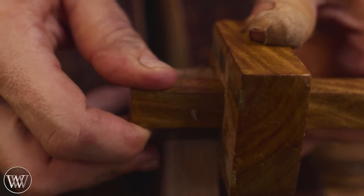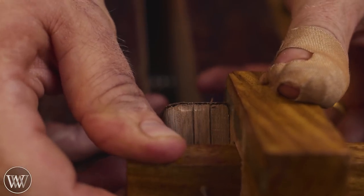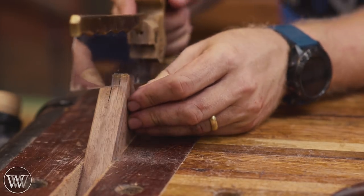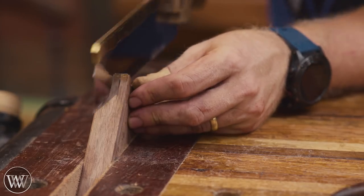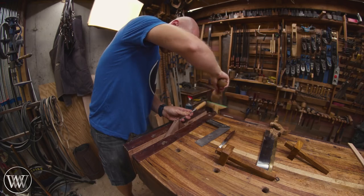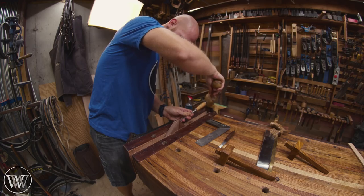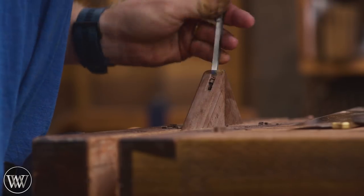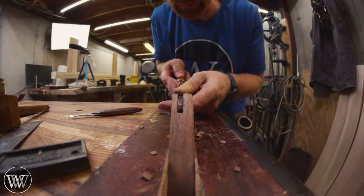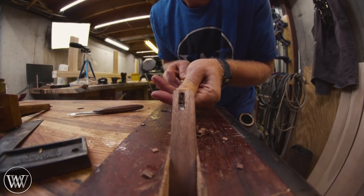I have a mortising gauge set up to the thickness of my mortising chisel, and I can put some lines down either side of the corner, about three-quarters of an inch to one inch down. Then I can come in with a dovetail saw, follow those lines right down to the bottom of the cut, and I'll basically have a 45-degree kerf on the corner. Once I have that done, I come in with a chisel matched to the width of the mortising marks and clean out the waste between those two cuts — chopping in halfway from one side and then halfway from the other. Clean it out so there's a nice flat surface on the bottom, and the mortise is done and ready for a spline.